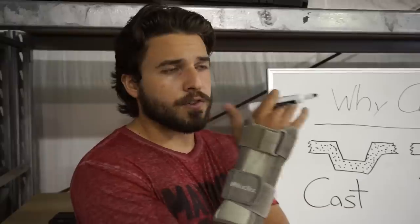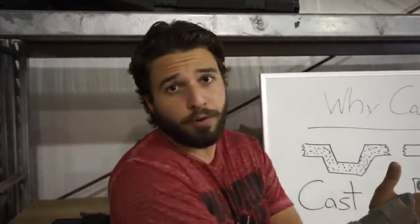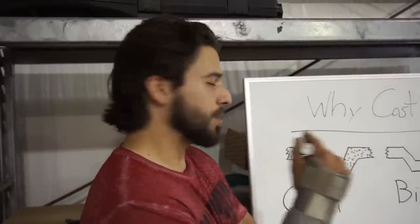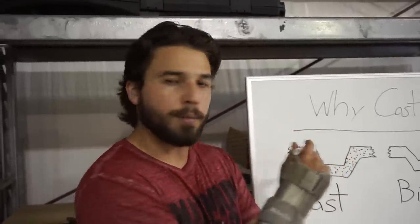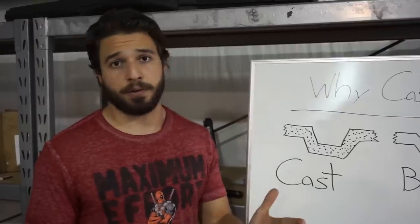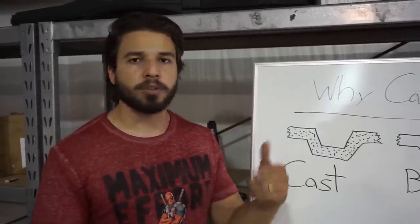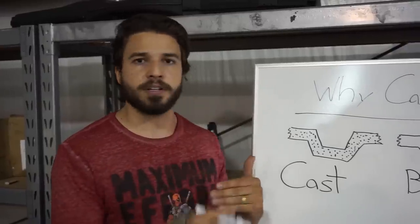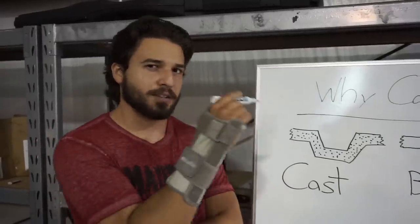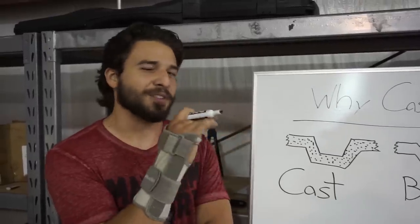So that's what casting is generally. When it comes to grain structure, the problem with casting is that you have no real grain structure. An even bigger problem is that the metal has a tendency to be somewhat porous, meaning there can be really small air bubbles trapped in it. The metal is really not the strongest it can be. I've seen cast bolts break, cast bolt carriers break, cast trunnions break, and they all look the same. If you look up images of cast trunnions breaking, you'll always see on the inside it's a little spongy — the metal has little holes in it. You can always tell that means it's cast.